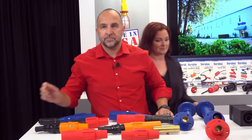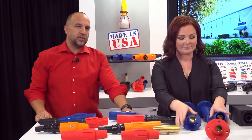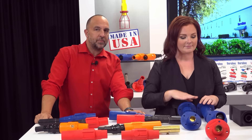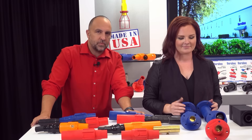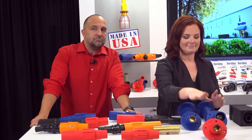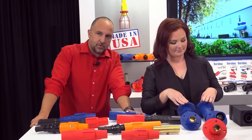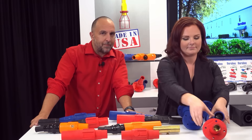We have a variety of receptacles to distribute power. They can be mounted on ship-to-shore pier panels, electrical panels, power panel packs, distribution panels, and generators. Available as a 15, 30, or 90 degree female or male receptacle, the 15 degree can be equipped with a micro switch.